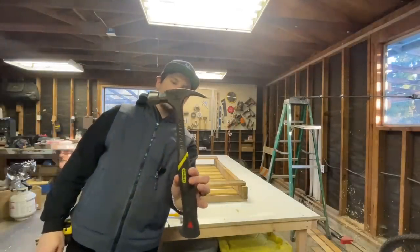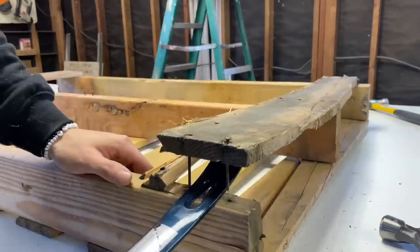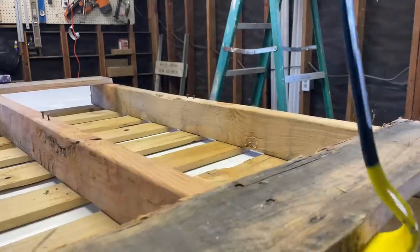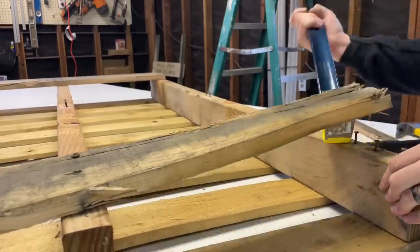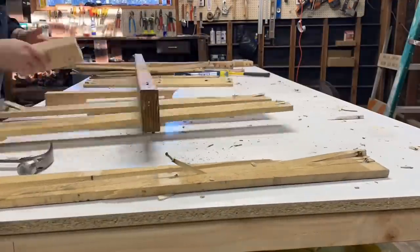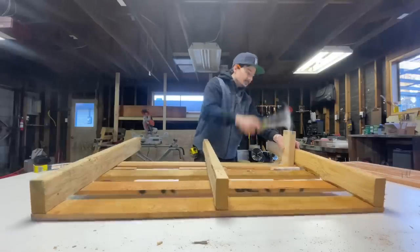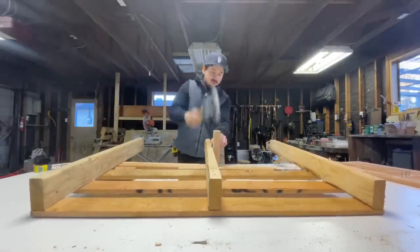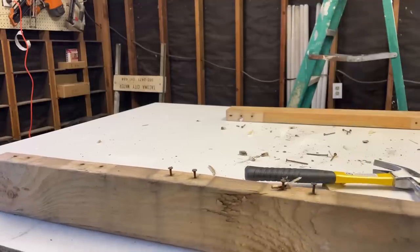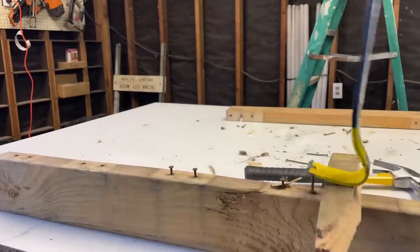We're gonna use a hammer that has a straight claw on the back and a flat pry bar. These two tools are gonna be your friend. Taking these apart is not exactly easy and I did end up breaking a lot of boards. I tried a few different methods, but I found that shimming up the pallet with a few scrap blocks of wood and then hitting the slats out with another scrap block worked the best — it's both the fastest and the cleanest. If you're having trouble pulling nails out, just grab another scrap block and place it underneath your pry bar for more leverage.